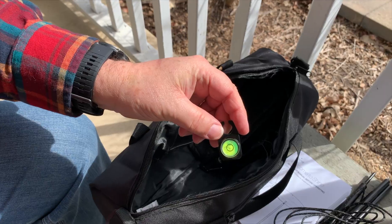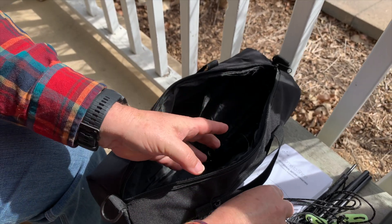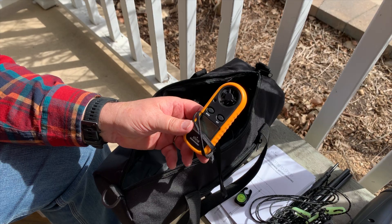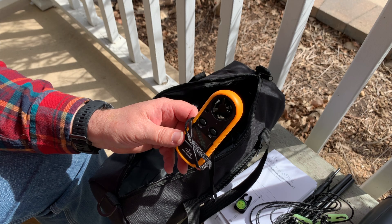We also have three guy lines mounted to a central hub, a leveling ball to make sure that you get it level and make it most efficient. The kit I got also came with an anemometer that helps gauge whether or not we have enough wind for this to generate electricity. The turbine itself is rated to produce up to 40 watts of electricity, has a built-in 12 amp hour battery, as well as an MPPT charge controller, making the entire unit a self-contained charging and power management system.